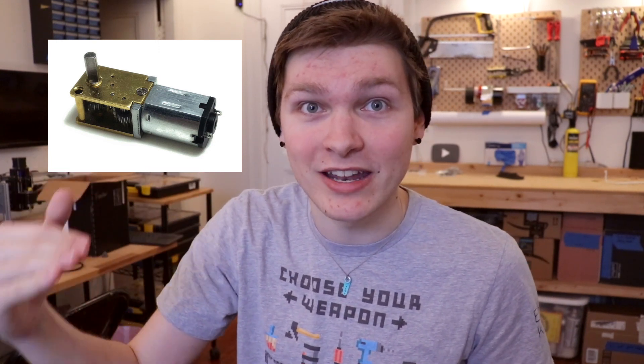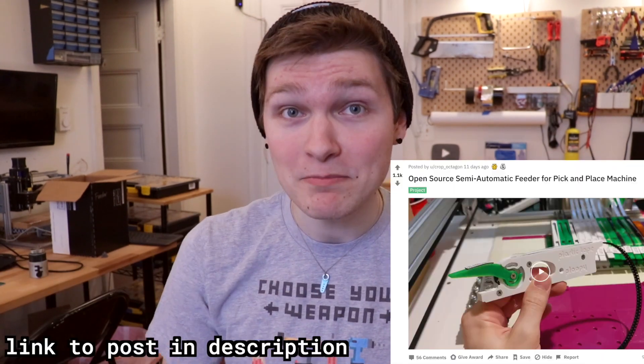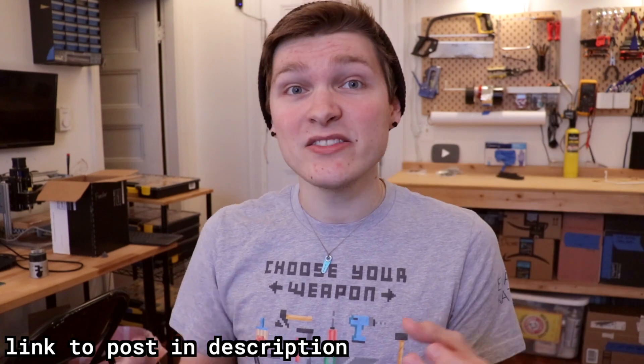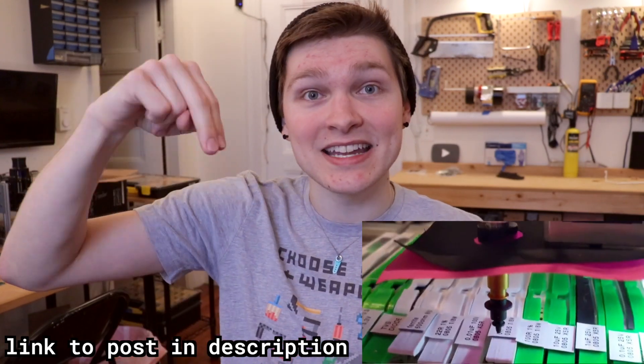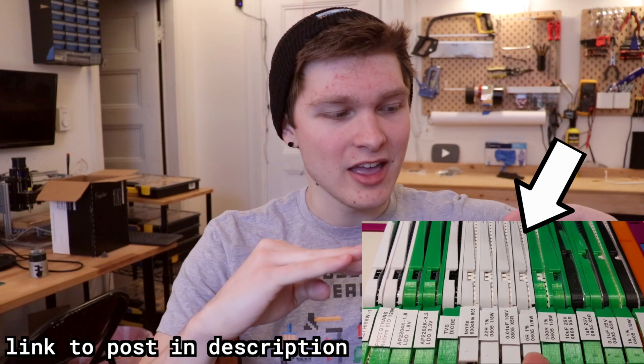You can buy a little N20 style motor with a right angle worm gear gearbox on the end of it — I have one coming in the mail. The second thing that happened was a comment from rcdude10tc32, who linked me to a Reddit post of an awesome feeder design that's pretty passive. It just uses the pick-and-place head to manually index tape forward, but the way they handle film peeling is awesome. They use the force of moving tape forward to passively peel the film up — it stays attached on the left side but gets just enough out of the way for the head to pick up the component. This totally solves my second problem — I don't need the fancy gear mechanism to peel the film.